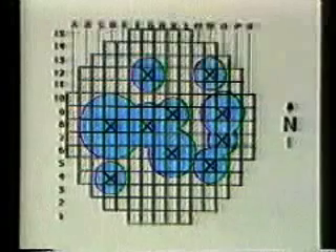Videotape surveys were then performed in each three-and-one-half-inch diameter hole. The middle of the core region was found to be a solid mass of once-molten material that extended as deep as five feet at the center of the core. This mass was found to be quite hard and brittle, apparently ceramic in nature. Visible in this mass, particularly near the top, were metallic streaks and clumps, which apparently were partially melted end fittings and other structural components.